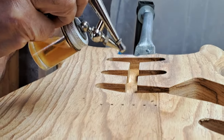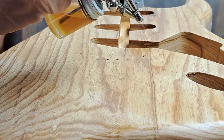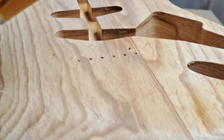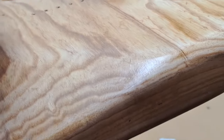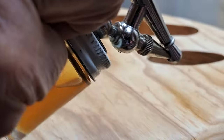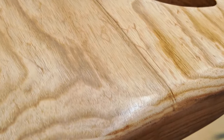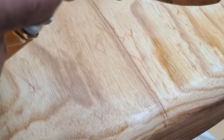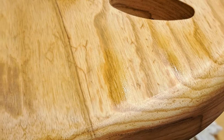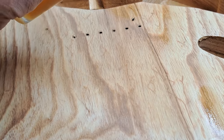What I'm doing is hazing over that glossy part — it makes it easier to sand when the time comes. You can see on the surface when I haze over the top of that. Yeah, it's hard to catch on camera, but you can see it with your eyes. Now that I see there's a tiny little spot, I'm going to open my gun up a little more here. Now you can kind of see it happening. That will sand out now. These are really light — they're one scuff away from being filled. It was that one I didn't like — just that one. But that one will annoy you on the guitar forever; in the rest of your paint job you'll be chasing it in the clear. Swamp Ash has that sometimes.